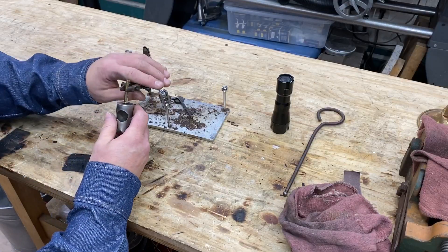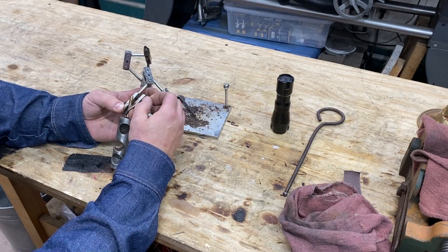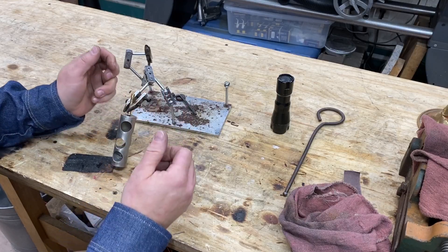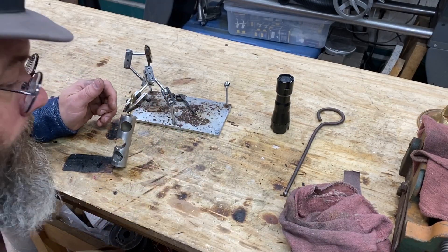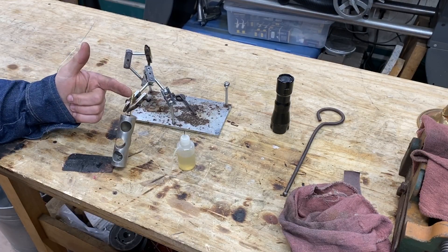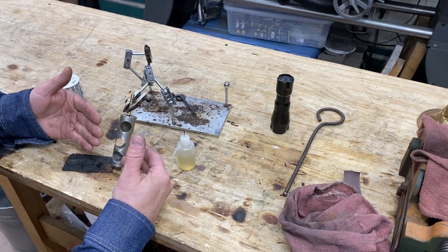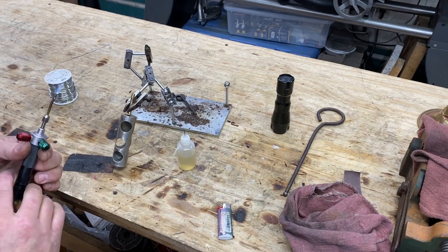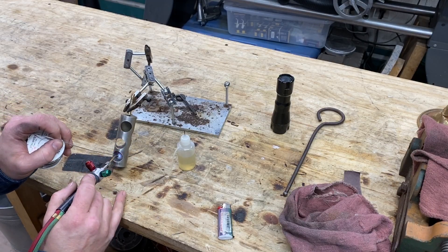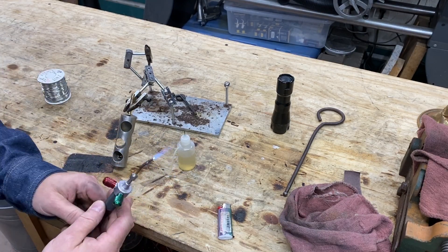This really could be a candidate for a drop fill, so we're going to do that now. While I'm getting this into position, talking about solders — low-temp silver solder is 60-40. Normal solder used in band instrument repair is around 70-30, a higher melting point, but it's not to the point of brazing. It has more strength than just a regular soft solder. I put the valve stem back in — I didn't clamp the piston in a vise. You also have to be aware of your heat.